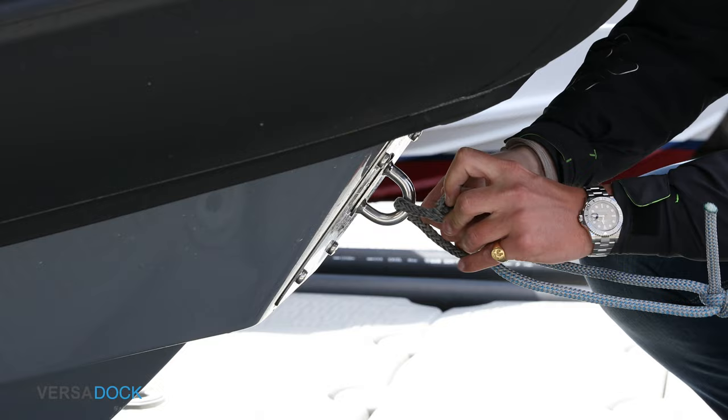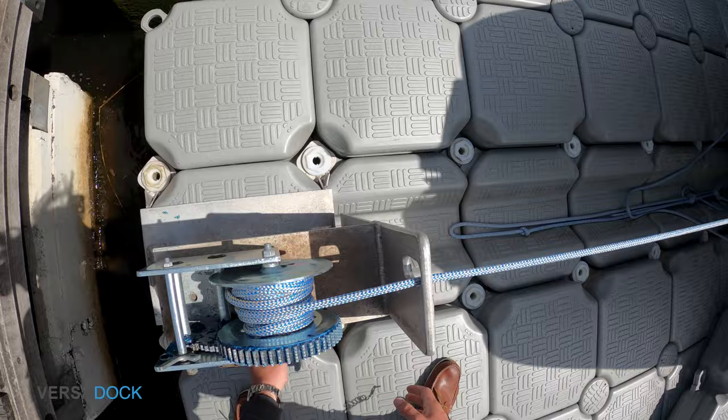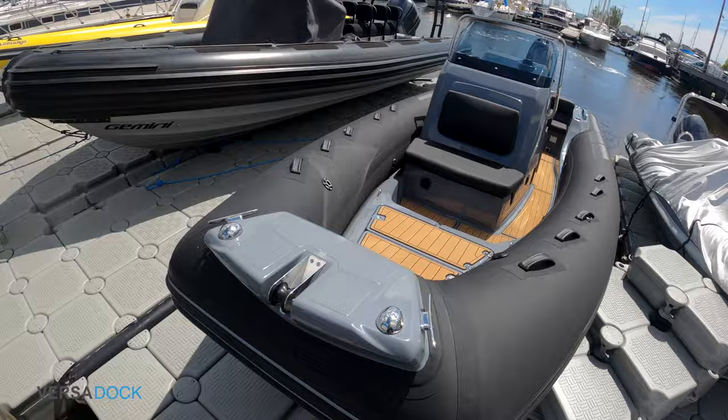Reconnect the bow line and take the tension up on the winch. If the boat needs to come further onto the dock, you can use the winch to draw it forward. Always unload the winch and leave it only slightly tight to avoid fatigue to the working parts and to prevent the next user from an incident.